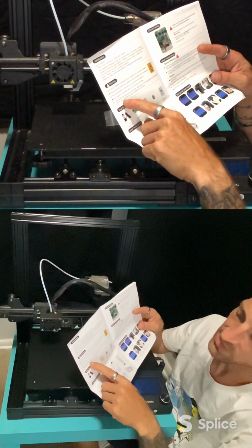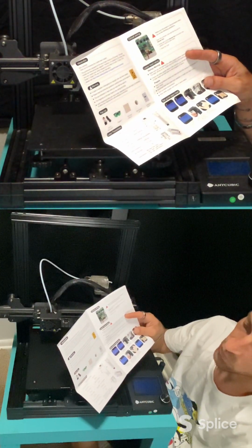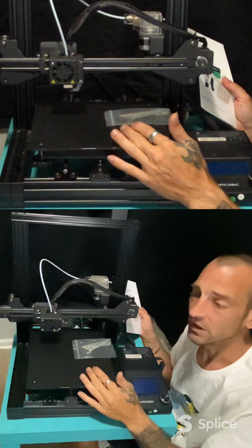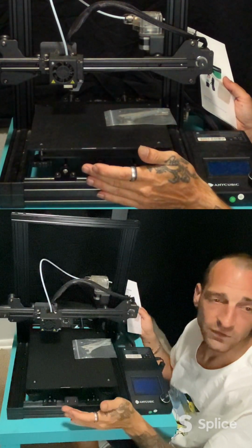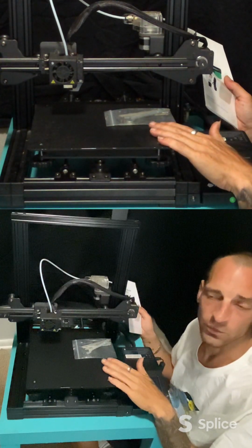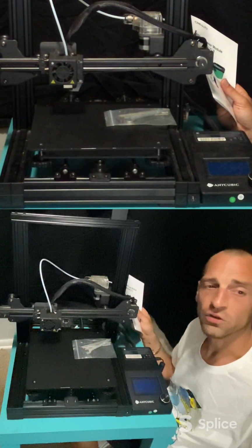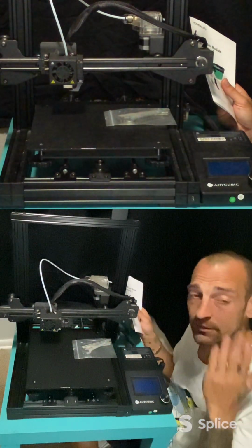And last thing, laser engraving cutting can cause smoke depending on the workpiece. It is necessary to place your machine in a well-ventilated environment. So yes, if you are engraving wood, you are going to get a wood burning smell. If you are engraving plastic or acrylic, you are going to get some sort of fume, and we all know smoke and fumes can be toxic and it's not the best to breathe in. So make sure you have a well ventilated room that you are using the laser, or better yet, you can always take it outside, but if you do, make sure there is some sort of enclosure or barricade around it so people passing by don't stare at the laser and risk damaging their eyesight.